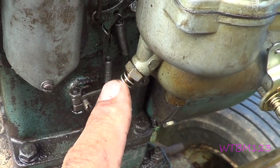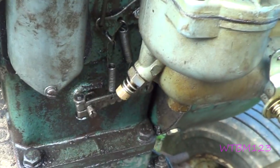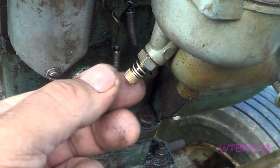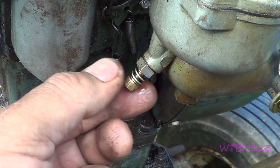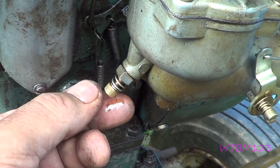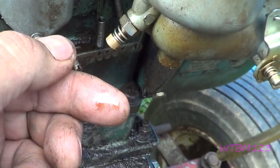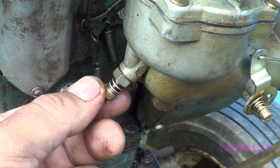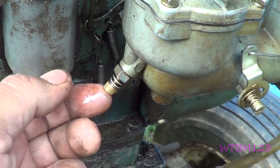You want to get the tractor warm. It starts out at one and a half, and that's not a factory setting like people say — that's just a good starting point to start adjusting. So you get the tractor wide open and warm, and then you can turn this out or in and listen to the engine. When you turn it out too far, it'll start cutting up a little bit and dropping, not running quite as smooth. Same when you go to the inside — when you screw it in too far. What you want to do is screw it out or in until you get that happy medium in between, and it should run all right.